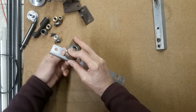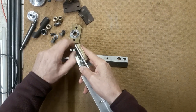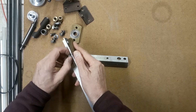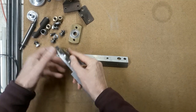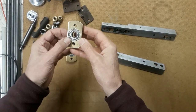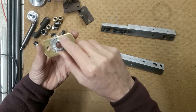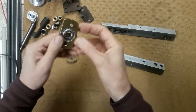There are a couple of things I don't really like about this as I look back on something I made many years ago. The first is the use of very expensive materials to make the bearing housing — you can see here I used brass. That's material I had available to me at the time but it's a very extravagant use of material. You can also see here that I made a little mistake in the mounting of that bearing and I soft soldered it — tinned it — in order to make up the correct clearance. Anyway, that was a bodge from many years ago.